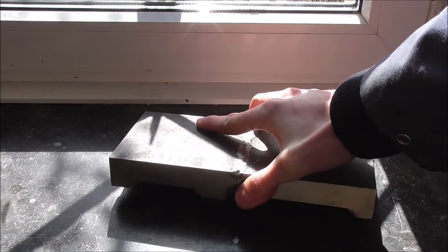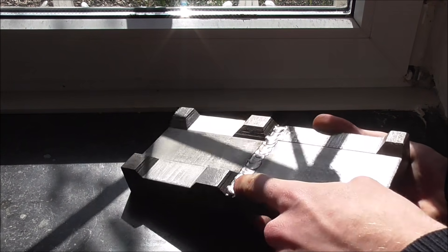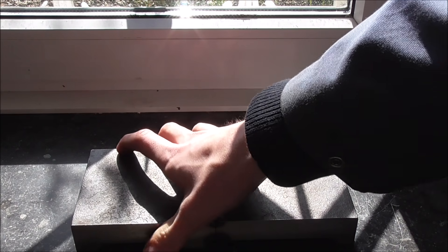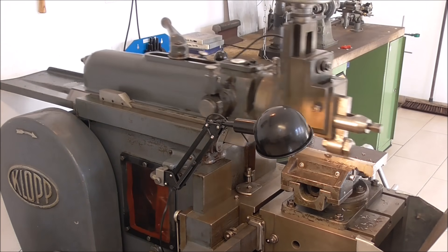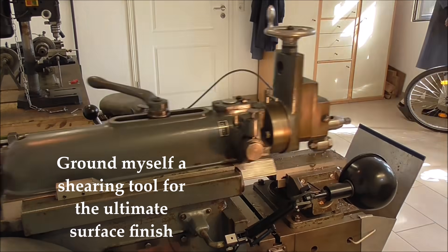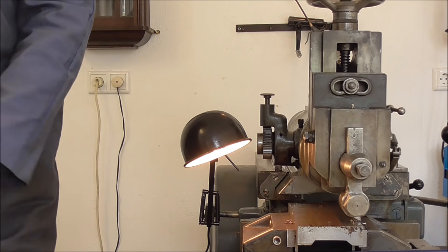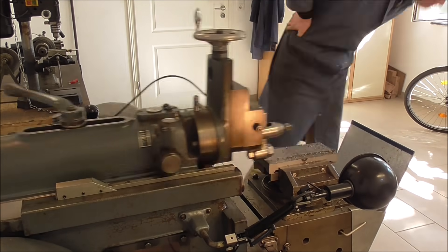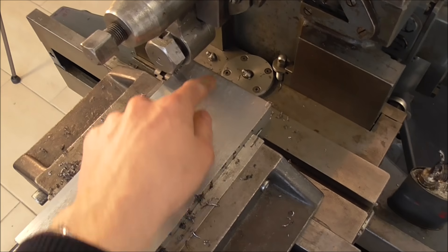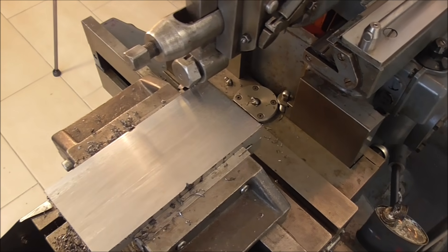Get a load of this guy, eh? What we're going to do next is of course clean up the weld joints. I'm not sure as to how far I'm going to clean up this — probably just blend in the radius because nobody's going to be looking underneath here anyway — and get this surface smooth, and then we can deal with getting the angles on the sides. This will take forever. So we didn't clean up all the way. Right in here there is a section where, probably due to the parallel sticking out so far, we didn't clean up. So we're going to do it again, and again and again and again.